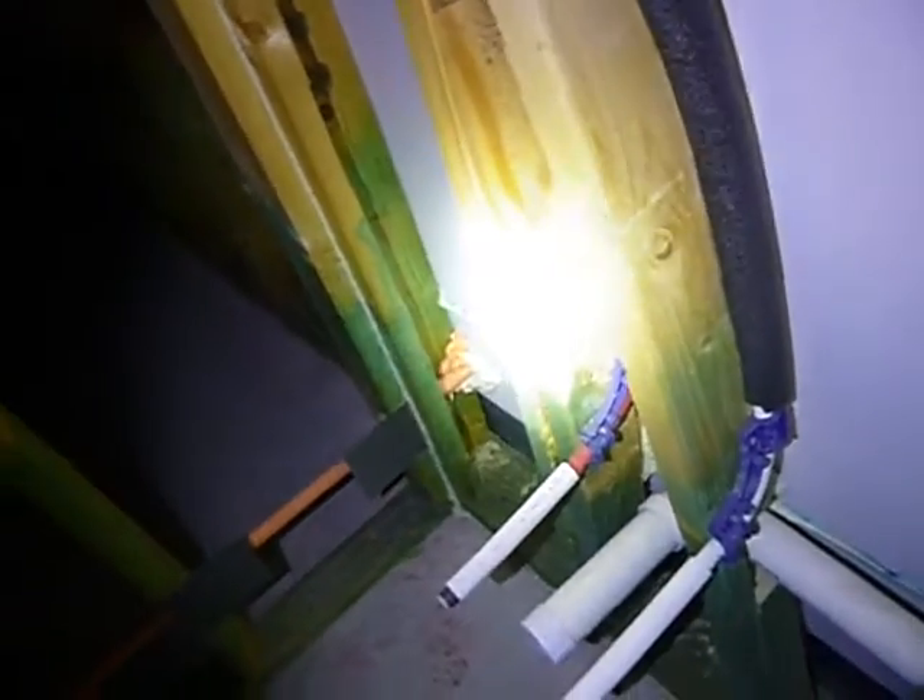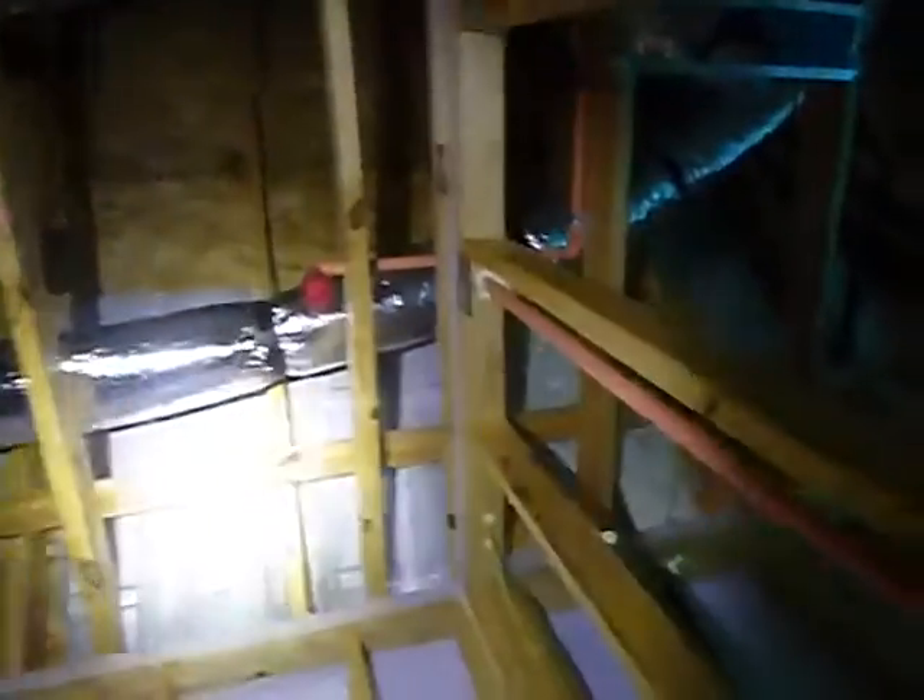This is the main water shutoff valve for the fire suppression system. I don't inspect fire suppression systems — they're supposed to be approved some other way. This is the testing valve for the fire suppression system. It goes out on the east side of the house — I'll be looking for that later. We use this valve to flush the system and fill it with fresh water.